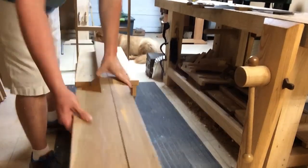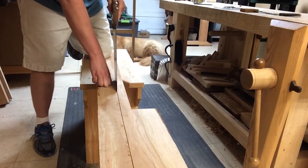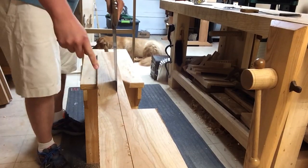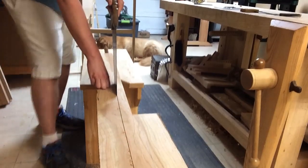There's my two-foot mark — I'll flip the board again and continue to work down my line. These two-foot marks give you something to shoot for. When you're working on an eight-foot board, it seems like the longest rip in the world, but if all you're doing is working to that next two-foot hash mark, it makes bite-sized pieces that make the whole thing a heck of a lot easier.